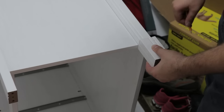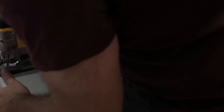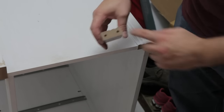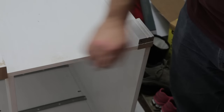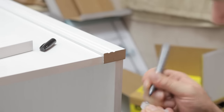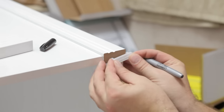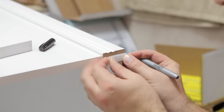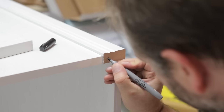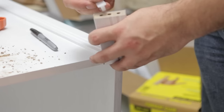Now I just have to rotate the cabinet and perform the same cut on the other two legs. Next, I need to transfer the two holes to the new bottom of the cabinet. This dresser comes with four little plastic feet. Rather than drilling with exact measurements, I put some ink on the bottom of the knobs and pressed that ink into the bottom of the cabinet. This left me a few marks as good reference points, so I marked the centers so I'd know where to start my drill.